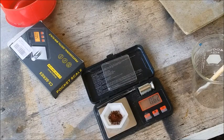Like I say, I'm not really a big fan of the wet ashing process. It took a long time. It used a lot of sulfuric acid, which I think probably is a lot more expensive than a little bit of propane my foundry would have used to ash those chips. But on the other hand, a lot of people don't have a foundry, so the wet ashing process is probably their only viable method of doing this if they've got a lot of Gold Corner BGAs.